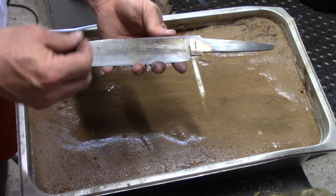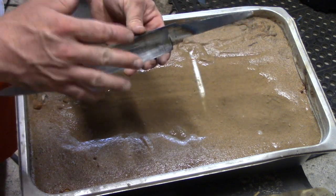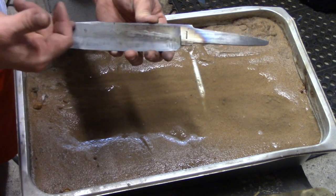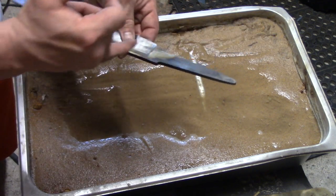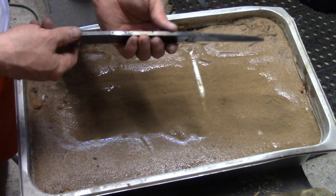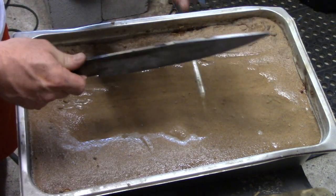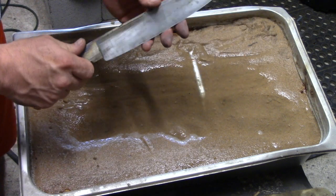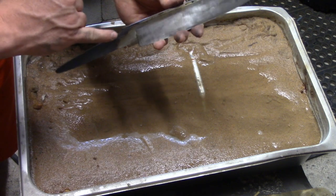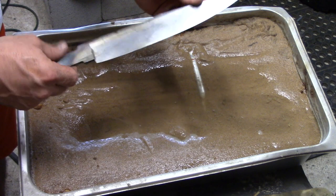I will say, if it's a smaller blade, like something under, you know, a 5 or 6 inch blade, I skip this step altogether other than the tang. I don't worry about the satanite coating on that, and I don't worry about heat treating the ricasso and all that. I don't need to worry about it because it's not a heavy impact knife. But anything bigger than that might be, you know, baton through steel, through some wood, or something that's going to hit something like a tree or a limb, I'm going to make sure that these stressful areas, the areas that impact that stress, are heat treated appropriately, and then I've taken the appropriate steps for that.